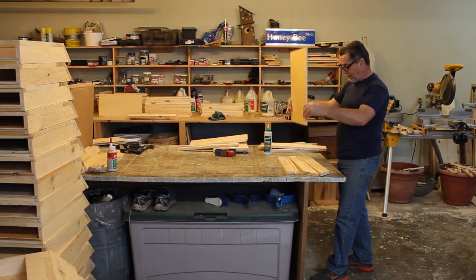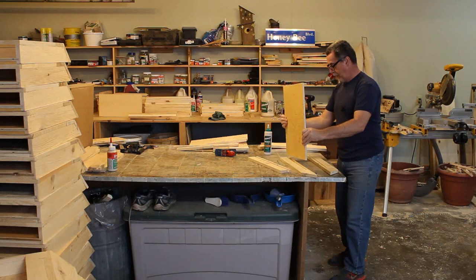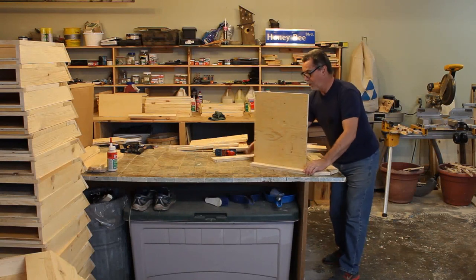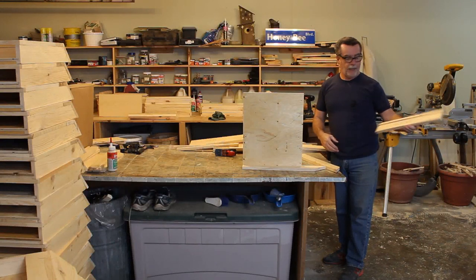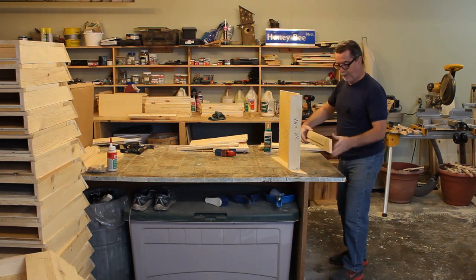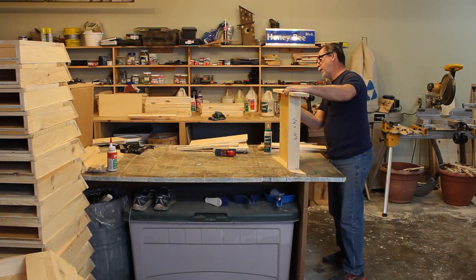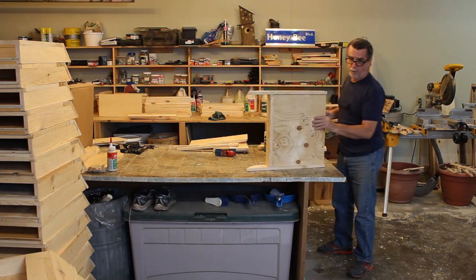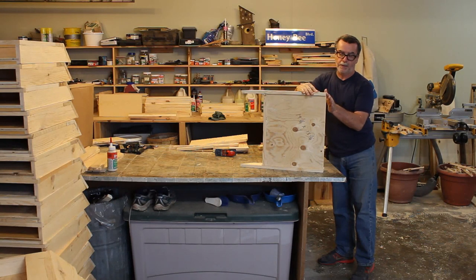I take the 15 and 7/8 side piece and line the plywood up with the back. Then I take the three and one-eighth by eighteen-and-a-half piece and slide that on. Then I take the mating side piece — making sure the 45-degree slopes are going the right way — and put that on. I've already dry fit it once so it's a little loose. The glue does most of the work but I like throwing an air nail in to keep things positioned. I get the back surface lined up.